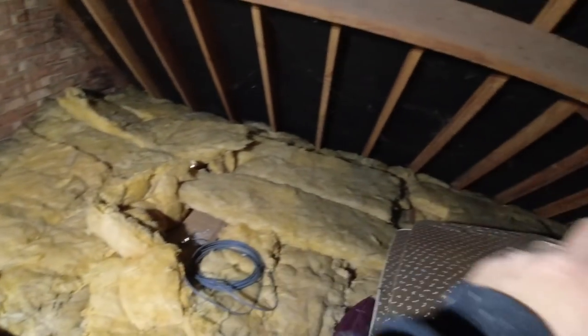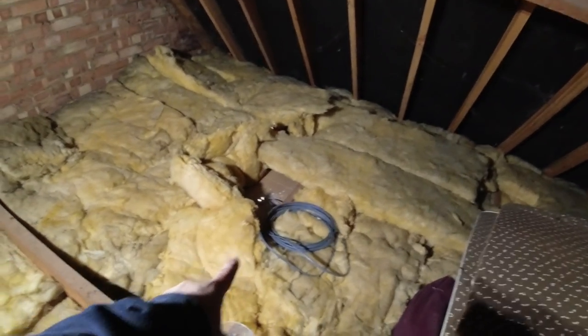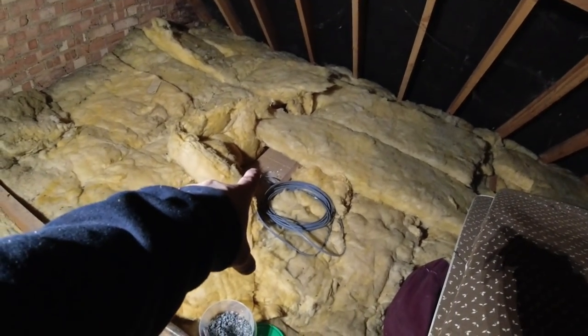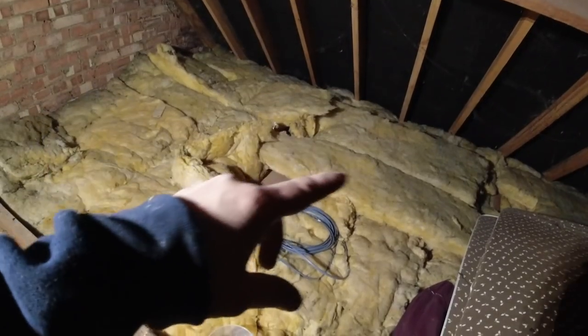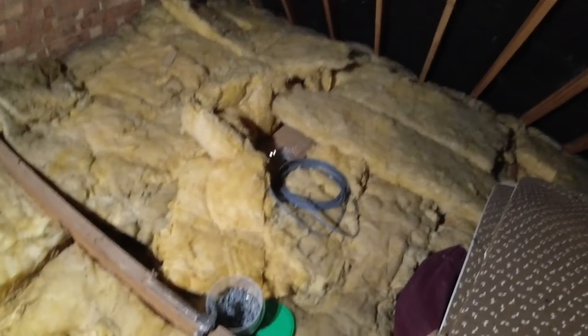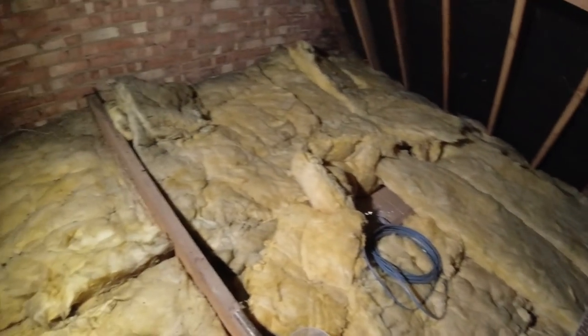We're going to have a storage heater in this one. So we're wiring two circuits up for the storage heaters, off-peak and mains. And then Andy's just about to wire up a lighting feed for the loft area and a power circuit, which is going to do two bedrooms, be a 20 amp radial. I've already wired up a smoke alarm.